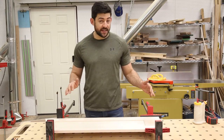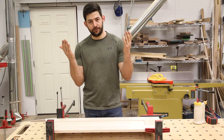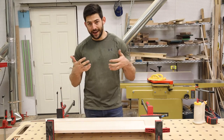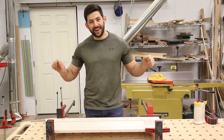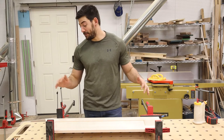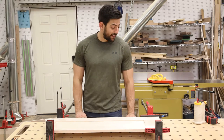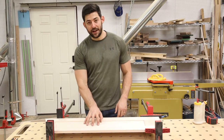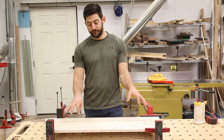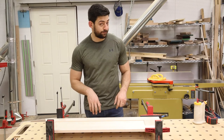The panels went together really well. The spacer balls really helped with alignment — you put a little clamp pressure, the rubber balls create friction but you can still slide things around, so you can get everything lined up, then slowly tighten up as you get it perfect. They're about two bucks, so definitely a worthwhile addition. The balls keep the panel from rattling around and prevent finish from cracking where a floating panel might slide.